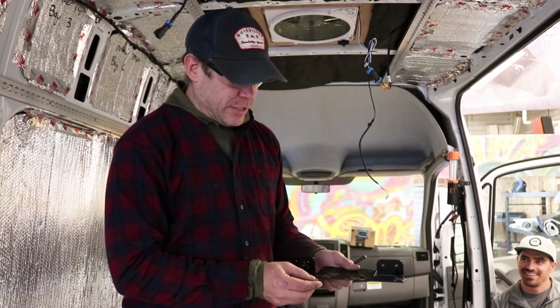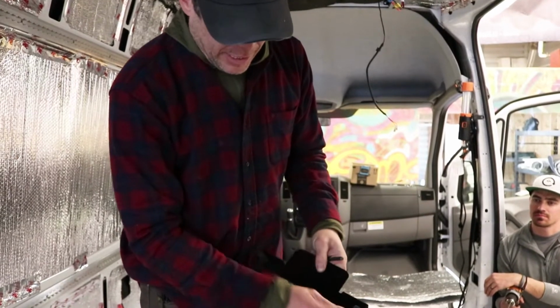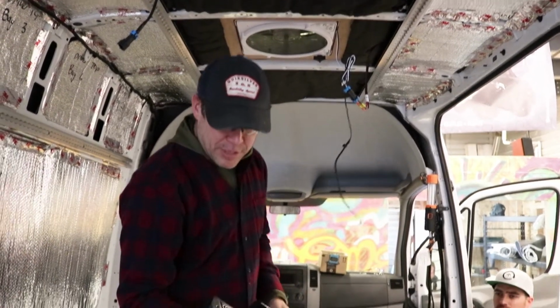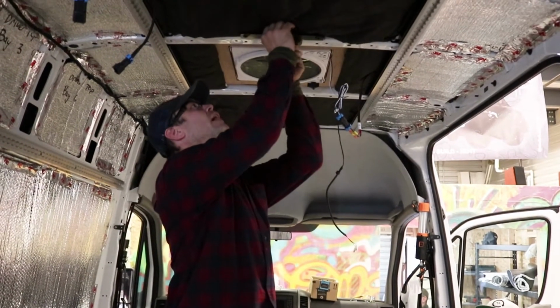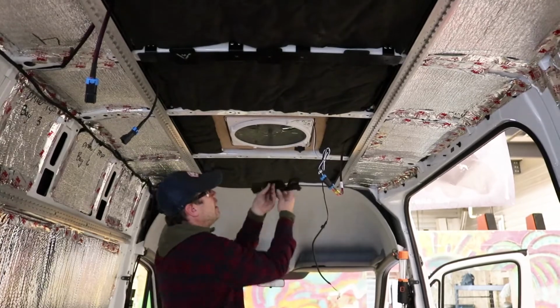These are the pieces that go into the center of the vehicle. These clips right here slip on the ends where these holes are, and they're floating around, and that's what you screw into when you put the panel in. That's what holds the center of the panel into place. So to put these in, it's the same method. You put your 5/16 inch guide, either a bit or bolt, through the center, put it up into the center hole, and then punch your holes and set your 3/16 inch rivets. Just like that. You do them on the back and the front of each of the vans.